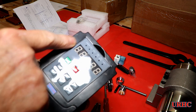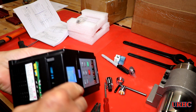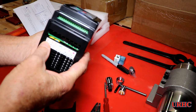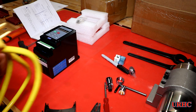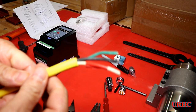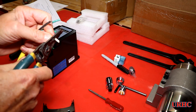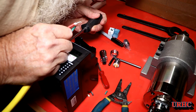This is the VFD. It looks a little beat up — it's brand new but you can see they didn't handle it quite right at the factory — but for $85 I wanted to try it. I'm probably going to buy another one eventually for my Bridgeport to replace the phase-o-matic converter. The wiring is pretty straightforward: you remove the little cover, I cut an old extension cord to wire it up to 220, and I put a red piece of tape on the white wire to mark it as a hot. It's a single phase input and three phase output.